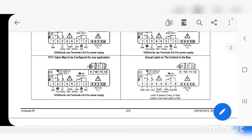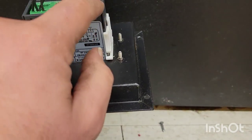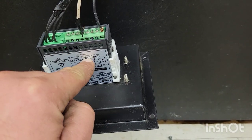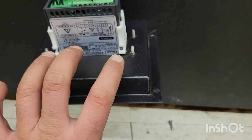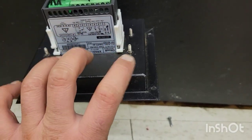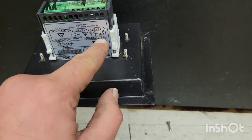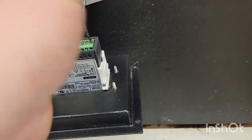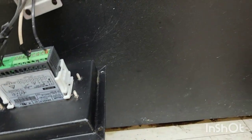Anyway, we're going to get back to the hands-on wiring. We've got our neutral on terminal 5. Count one, two, three, four, five — and then we're going to put the other supply wire on terminal 4. That controls our controller at 120 volts. Then on this side we have our line in, which gives voltage to our relays. This side goes out to the compressor — terminals 1, 2, and 3.